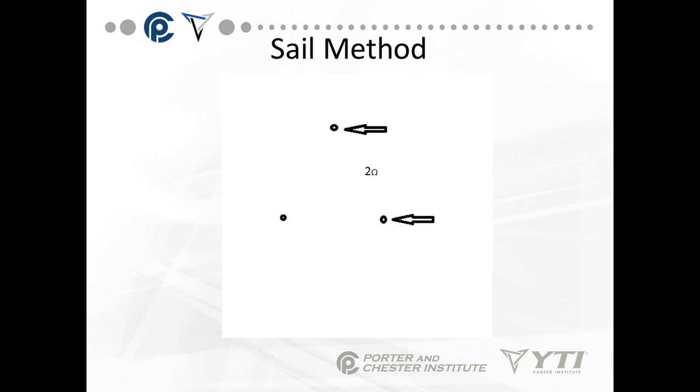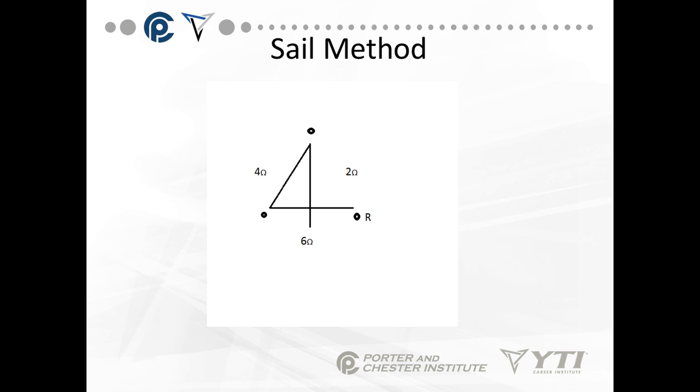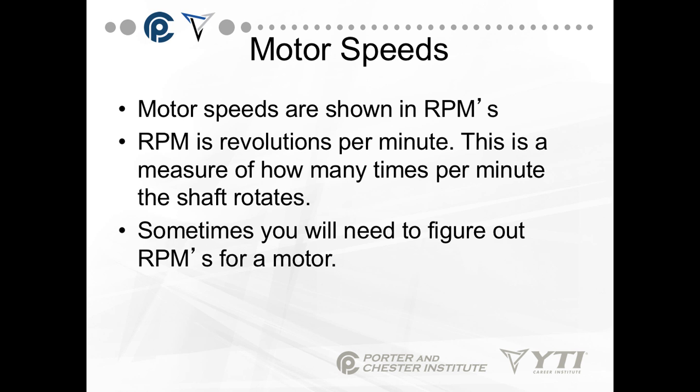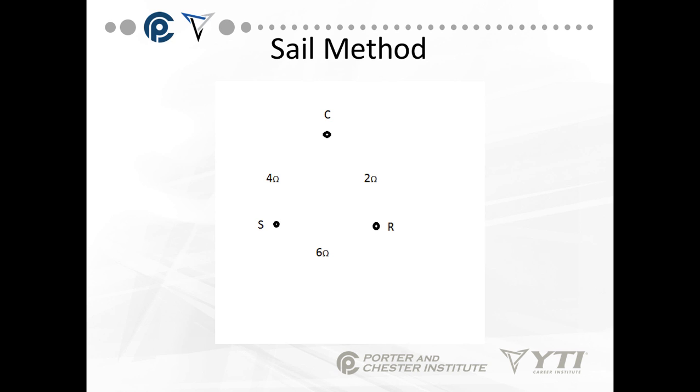The best way to do this is to write down C, S, and R in a triangle on a piece of paper and write down each measurement. If you have any doubts, go back and check again — you can do serious damage to a motor if you get the wrong windings connected. For example, if your three readings are 6, 2, and 4 ohms: the highest reading of 6 ohms is between start and run. The pin not included in that reading is common. Between common and the next highest reading is start, and the final one is run. Note that if you add the start and run readings — 2 plus 4 — you get 6, confirming your measurement.